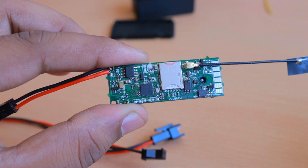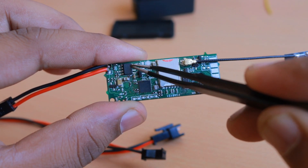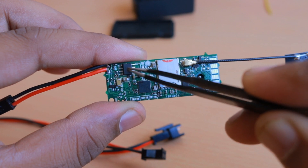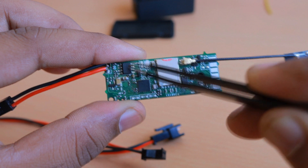This device is specifically made for vehicles. It can run up to 28 volts of input because of this switching regulator — the MP1584 switching regulator — which can take input up to 28 volts and give the 4 volts needed for the GSM module and other circuitry.